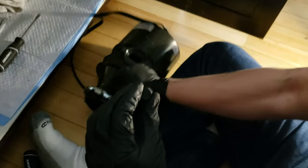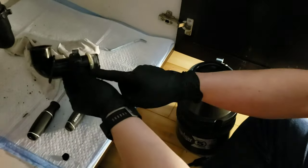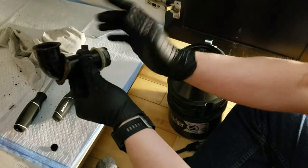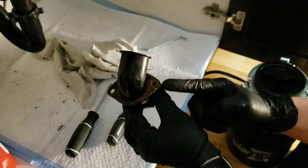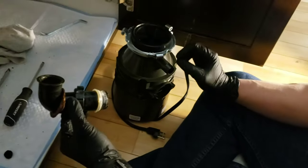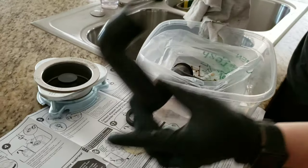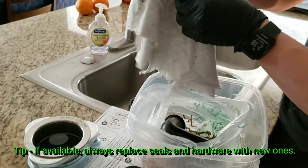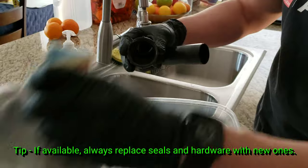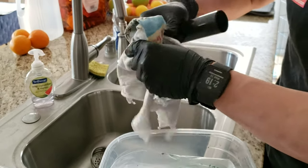It's a little disc — that's all you need to do. Then we're going to salvage and reuse the main bracket but replace the plastic piece and clean it up. There was a replacement seal included in the kit, and it's good to replace it since the old one is rusted. Whenever there's an exact replacement, use new parts — don't try to salvage old ones. That goes for seals, screws, any kind of hardware, because things have a life on them. It doesn't hurt to put in whatever new parts you can, and besides, they came with the kit.